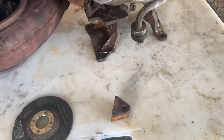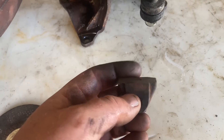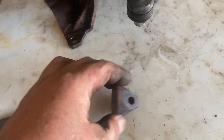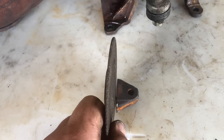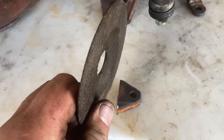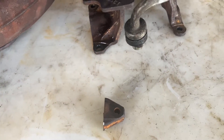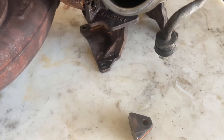The other thing I wanted to share is just a safety concern. With this metal being about seven-eighths of an inch thick at its thickest, and it's a good hard cast steel — when you're using a zip disc or whatever grinding disc you're using, you're cutting away and you're about halfway through. If you even bend a little bit, that crazy amount of RPM on there means that disc is going to catch and explode. That's what happened to me — it hit me in the arm, hit me in the stomach. Luckily, it didn't take me in the eyeballs.